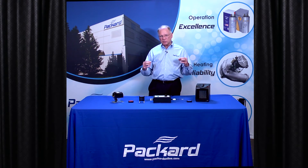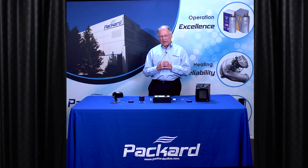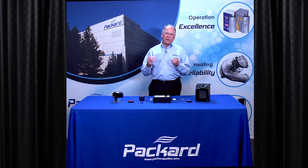Switches are opening and closing circuits. When I have power going through that circuit and across those points of contact, and I take that power away — I open that contact and there's still power going to that — it will cause arcing at that point. And that arcing will create pitting into those contacts, even weld those contacts.